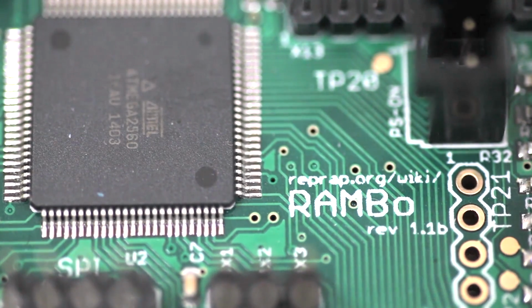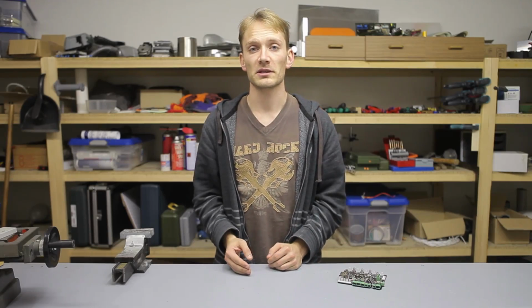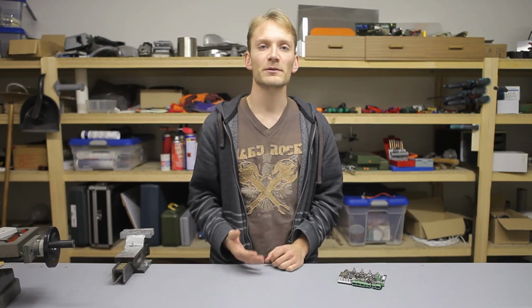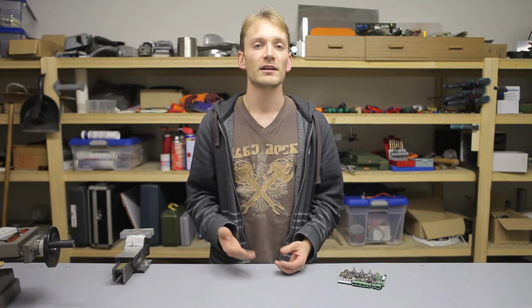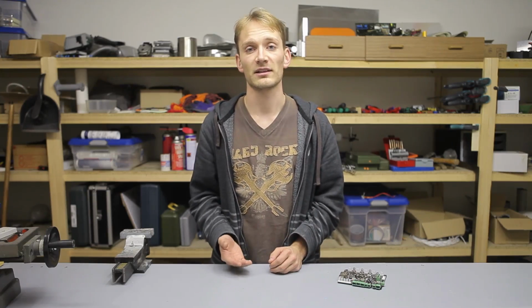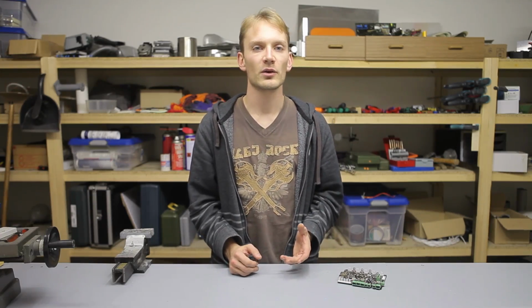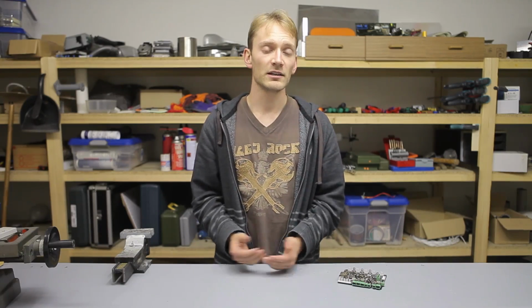Most boards are now using the equivalent of the Arduino Mega 2560, and that is the absolute end of the line for these processors. While most features were somehow adapted to run with the limited resources of the Atmega chips, many of them were stripped down or must even be artificially slowed down to run at all. Case in point, delta calculations. Right now it's a trade-off between precision and speed because this puny processor has no chance of accounting for the delta kinematics in real time. Or things like bigger color LCD screens, maybe even with a touch panel. No can do, not enough resources. And the thing is, even if you wanted to, there is no better or faster Atmega processor that we could simply upgrade to. And here's where the Smoothieboard comes in.